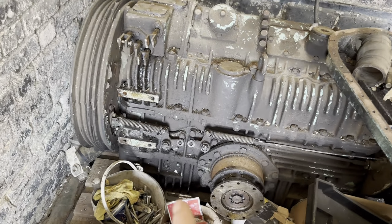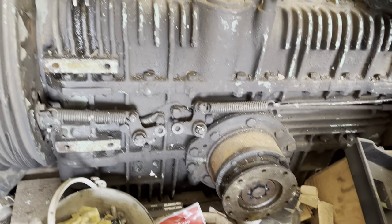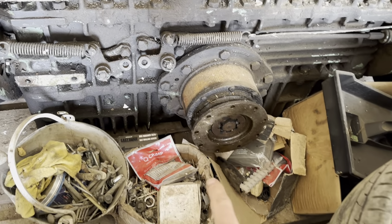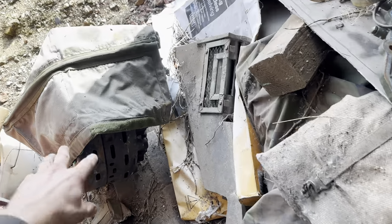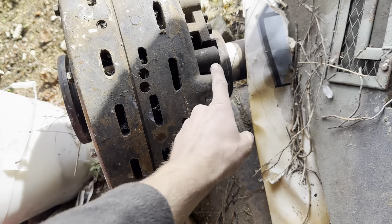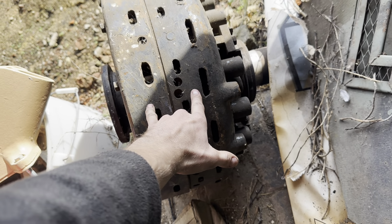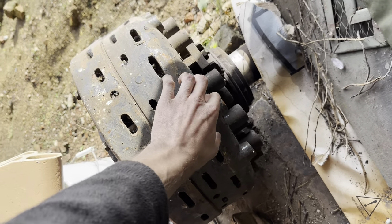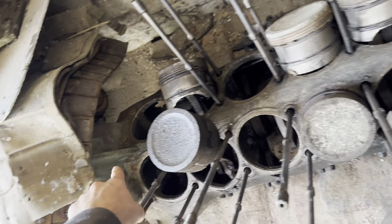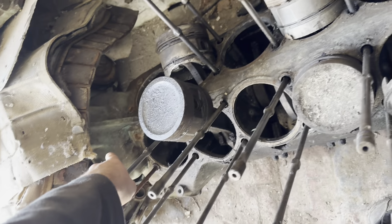And that's a gearbox for anyone that's not seen a gearbox for a Centurion. That's a gearbox, it's a Merritt Brown. And the way this works is, there's a clutch, which I have over here, conveniently. That is a clutch from Centurion. It weighs 1/4 ton. There's 3 friction plates in it, and that's your throwout bearing. A little bit larger than the car. And obviously that comes out the back of the engine, which is that side.